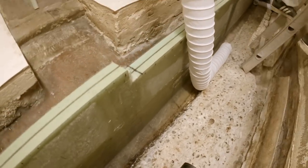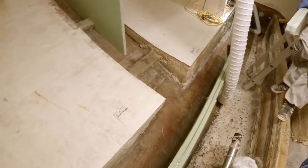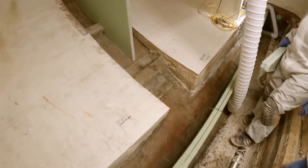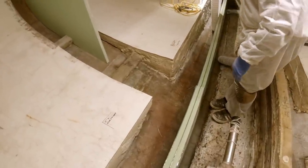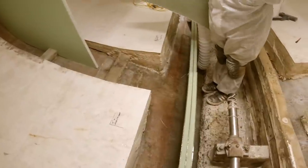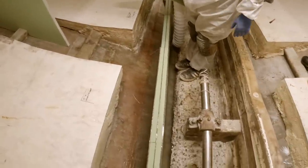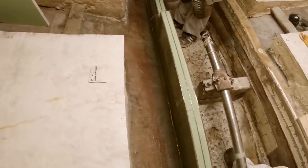That does happen when you laminate up some stuff and then you go home. If you sit here and babysit it, it's fine. You'll see them appear and you can take your roller and wet them out again, stick them back to the substrate. But like Dad says, you turn your back for one minute and it kicks off and then you're just stuck with bubbles. Anyways, it's really not a big deal.